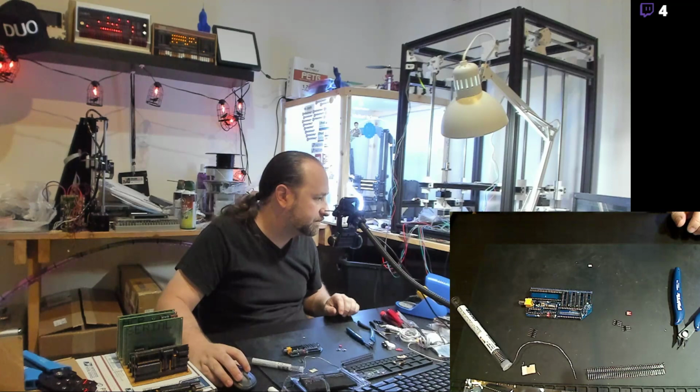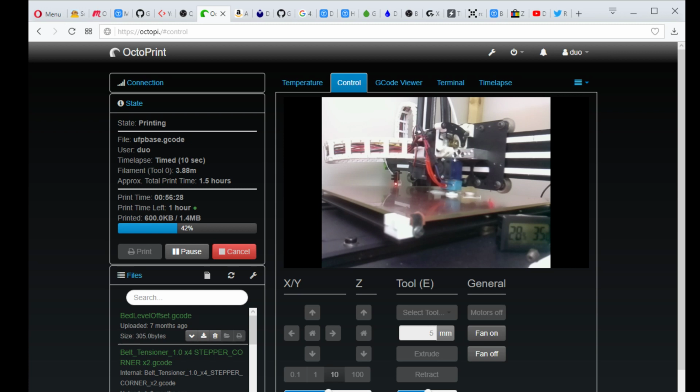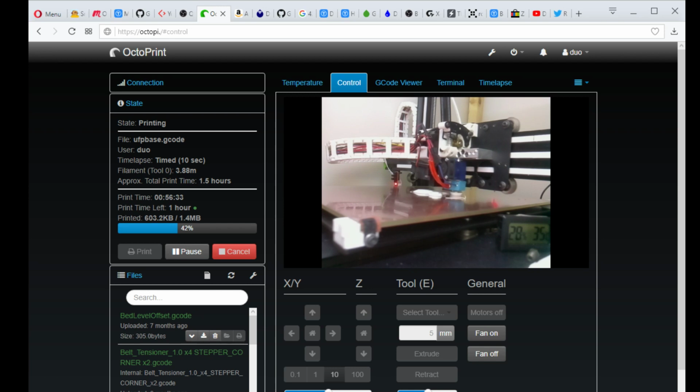You can see here in my printer that I've got going, these white mounting blocks on the corner of the bed. Those white blocks are actually this exact same roll of white PETG, or maybe it was a previous roll, and they've been run with that heat bed on it, all four corners, up to 120°C, and they have not deformed at all. That's the hottest I've used the PETG at, and it's fantastic. It's remained really strong, not had a problem with it.